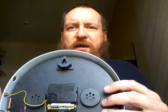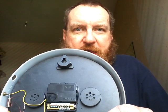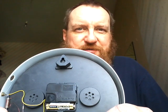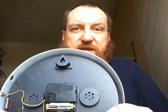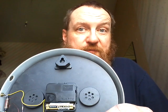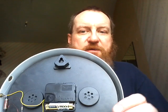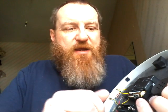However, it didn't work because the quartz movements in many of these clocks aren't super efficient. They operate fine at 1.5V, but the clock will stop when it gets down to about 1.3V, which is poor — because alkaline batteries' end-of-capacity is rated at 0.75V, half the starting voltage, so they only use a fraction of the battery's capacity.